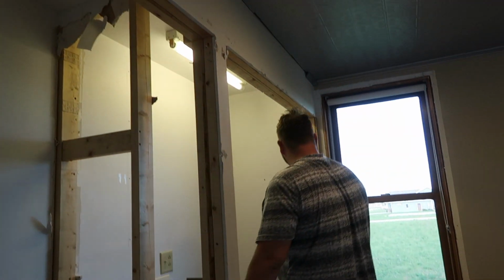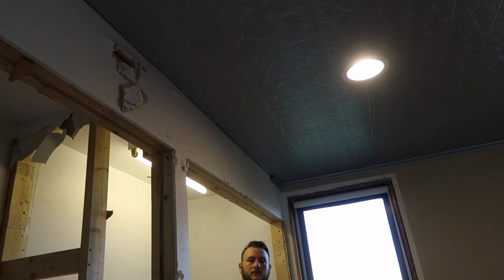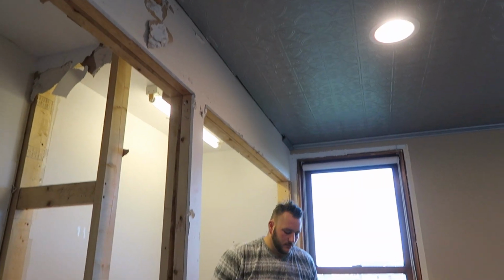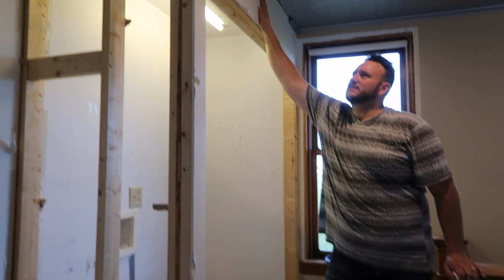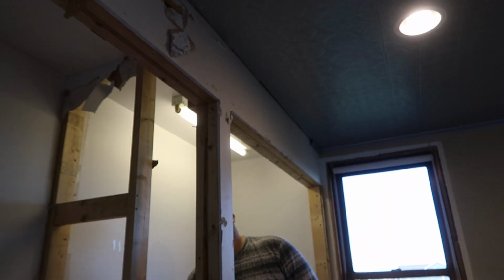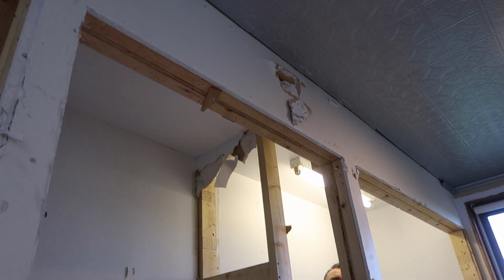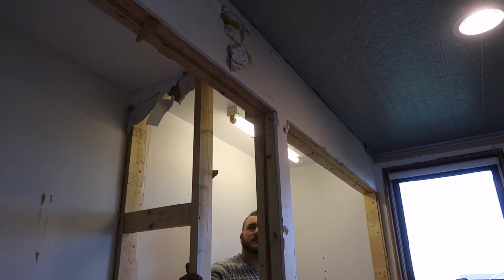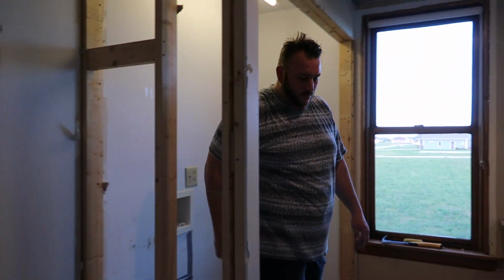And then you're gonna take down, are you just gonna take that saw thingy and just cut along the top to cut it out? Is that your plan? Yeah, maybe. I'm gonna take this drywall off and see what the framing looks like. I can see it there from this end, it's just a header over the door. It's actually just a header straight across. And it's just a 2x6 header. So it's not supporting anything. Okay.